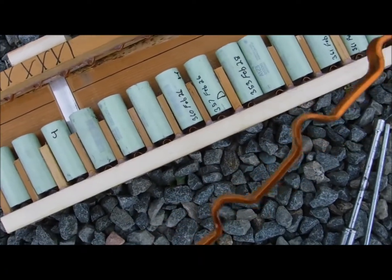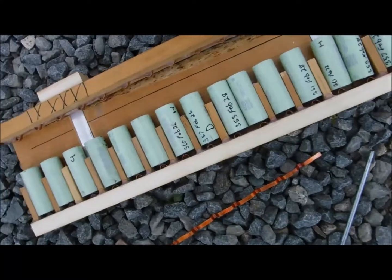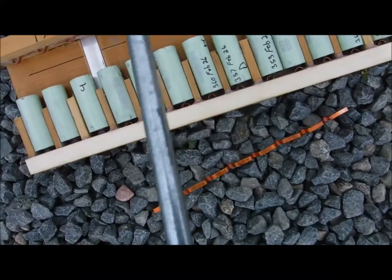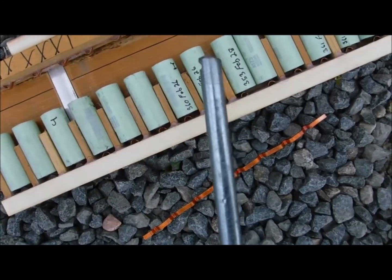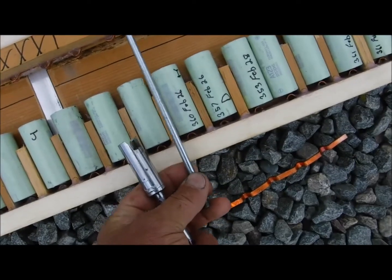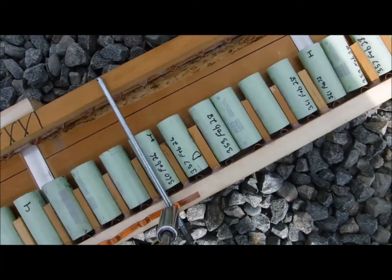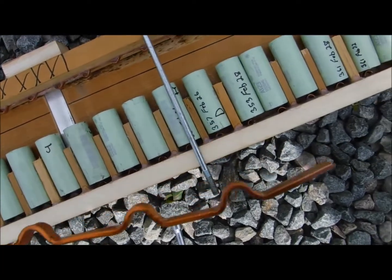To make those notches, those dimples, all I did basically was carve out a socket, just carved it out like that, and I placed it over a long bolt. I cut the head off of it, so when it went down on a flat surface, it was flat. The flat plate piece of copper went over it like that. And then I put the socket over top of the bolt and hit it with a hammer. And that was the result.